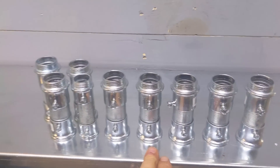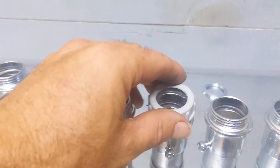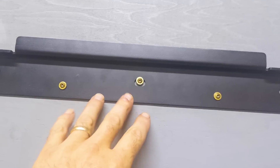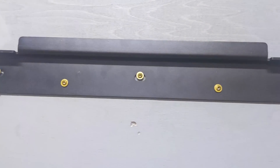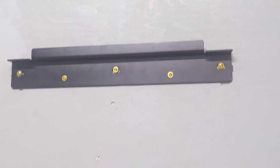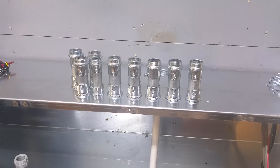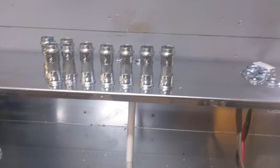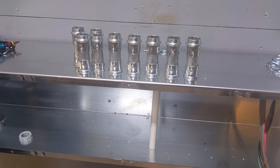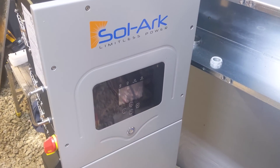We're ready to put the inverter on the wall. Using the template again, we get the EMT and set-screw connectors set up. These were not insulated, so we do add some bushings. The bracket comes with three holes, but we have a nice plywood backing so we run in some extra fasteners. The inverter is really supported by both the wiring trough and the bracket. We put a little spacer here to make sure the wiring trough isn't sagging under the weight. The 5K is going on the wall — get it, Abraham!